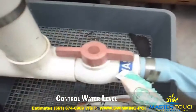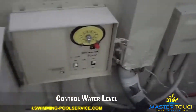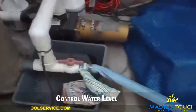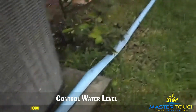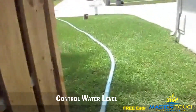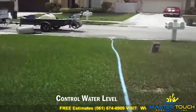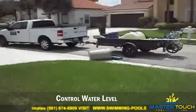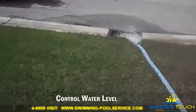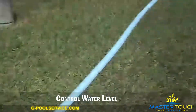What I'll do is just twist the valve open like I've done here, turn the equipment on, and the pool will prime. The holes are filled with water. My main goal is to control the water level and leave it towards the skimmer — at the middle of the skimmer — so the pool doesn't run dry.